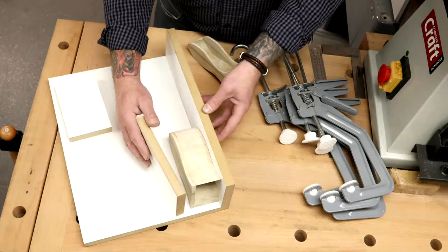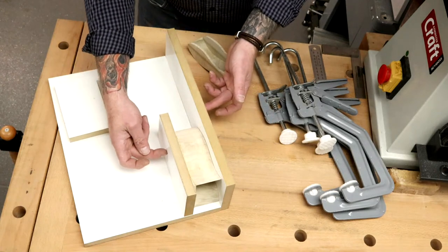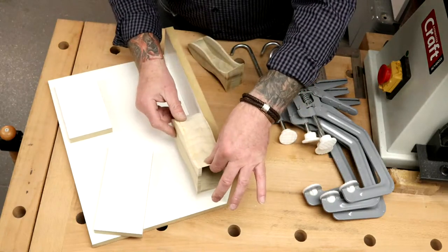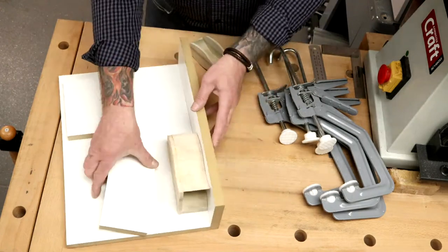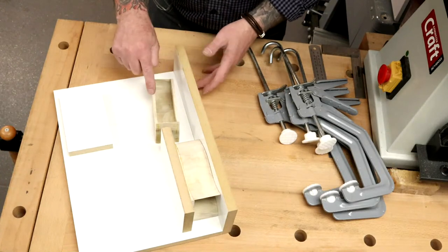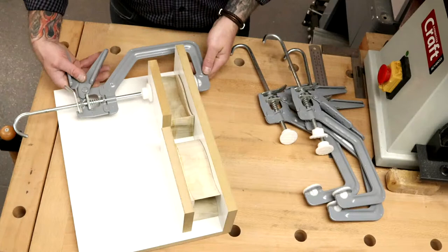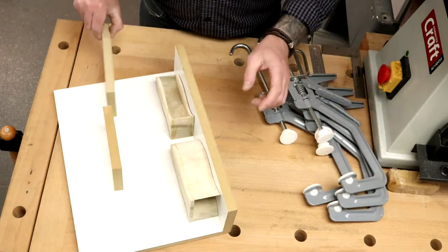I've brought in these pieces so that, even though I'm clamping there and there, I can expand my clamping area to cover the full width of my box. I've also got a positive area down the bottom there to help with alignment of these undersides. So it's a really simple little thing to do, and just the same on the drawer. We've got two sides instead of just one. That will come in, and the clamps just come on there. I'll do a complete glue up with the one we've just cut in a moment. But this is where we're at.